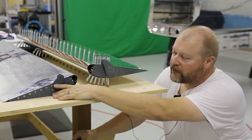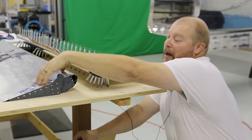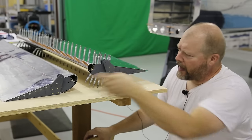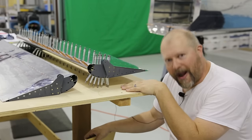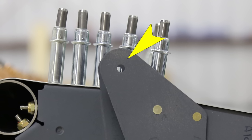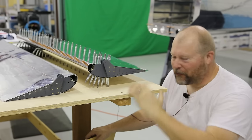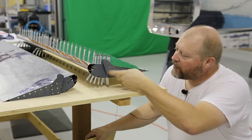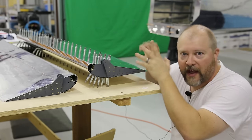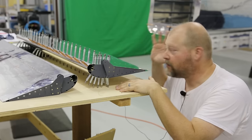You can see it right here — this line of rivets on the bottom, the pop rivets — these are the final rivets you put in when assembling the main ribs. On this side they're in the wrong place. This is the top and the bottom is up here — these holes should be here. At some point I got these main ribs backwards on the right one. So I'm going to pull this off. These holes don't line up and the skin is way off. I need to drill out some rivets here and on the other side, drill out the four rivets so the piece stays, swap the main rib on either side, and re-rivet them all together.